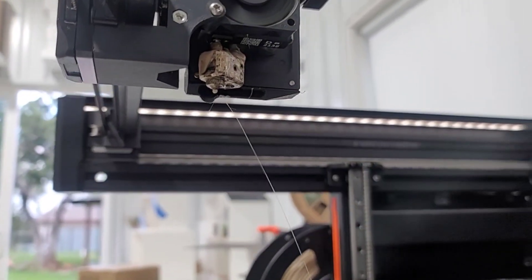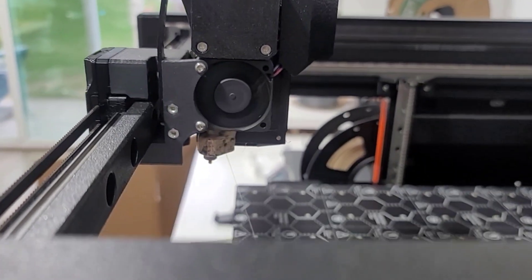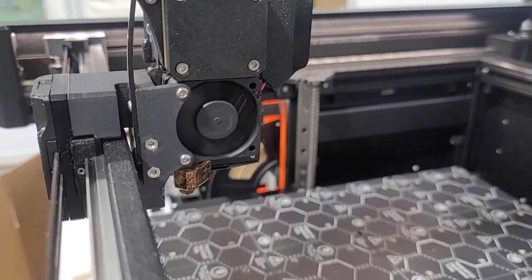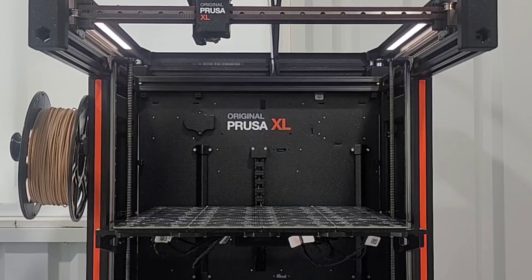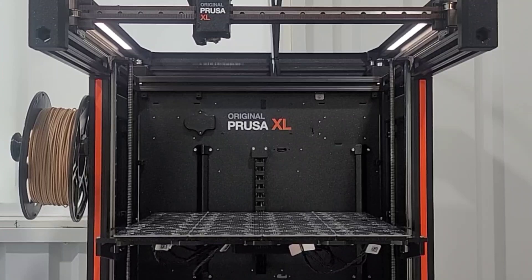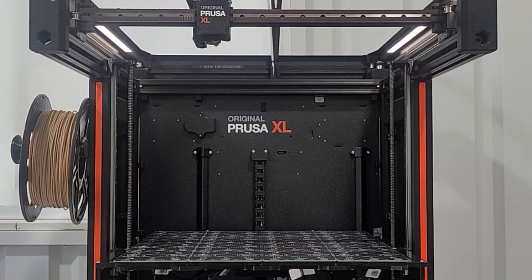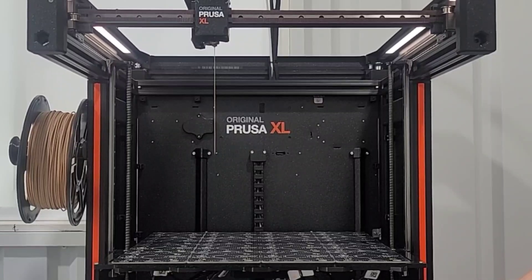From the side there's still a little bit left on top, but I also noticed that the fan almost seems like there's a little bit of filament in it. So I click the reset button to quickly turn the fan off, and once it slows down I see there's nothing crazy going on — I was a little worried something was spinning in there that shouldn't be. Since everything seems clean, I go ahead and purge the filament and do another purge just to make sure everything's coming through really smooth.